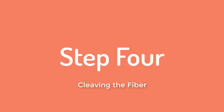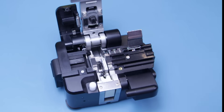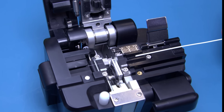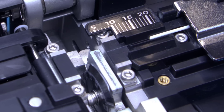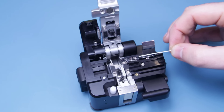As we mentioned earlier, the cleaver is the most important part of the whole process. We are trying to get a perfectly straight cut to allow the two fibre cores to make maximum contact with each other when they are fused together. First, place the fibre into the appropriate V-groove as indicated on the cleaver and flip down the magnetic panel to hold it firmly in place. You want to make sure that the bare fibre is sitting over the far left rubber pad as you can see here. By doing this, the cut end of the fibre will be swept straight into the bin. Should this not happen, you must remove the cut end from the machine manually using tweezers or sticky tape and place it in a sharps bin. Once the fibre is held in position, in one smooth motion close the lid of the cleaver and press down the cleaver button. When you open the lid, you will see the cleaved fibre. Lift the magnetic panel and carefully remove the cleaved fibre from the cleaver. From this point on you do not want it to be touching anything as this may damage or dirty the clean cut you just made.